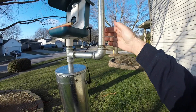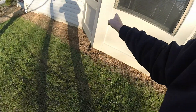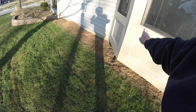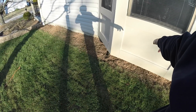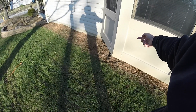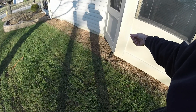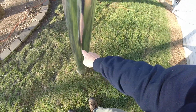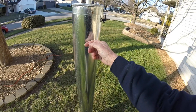Getting back to the cable: starting in my basement, I have a cable going inside the house into the basement. It has a little five-volt, one-amp power supply that plugs into an outlet and goes inside a flexible conduit to give this small cable some security underground. I bring the cable under here — I buried it — it comes up inside the five-foot duct, comes up to the very top, and I've got zip ties on the pipe to hold it. From there, I have a couple of pigtails.